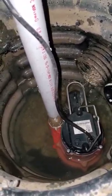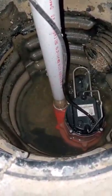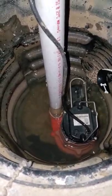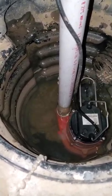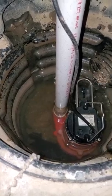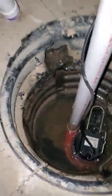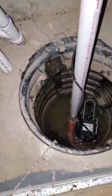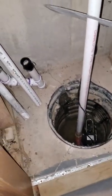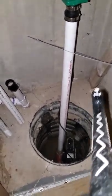The float switch had gotten stuck and it just took a gentle nudge to get everything working again. I'm making this video in case it helps somebody else — I usually don't make YouTube videos, but a couple of them were quite helpful to me. If you have a problem with your sump pump, first check the float switch. It might be something different, but if it's something this simple, don't go calling a technician on a Sunday morning like I was about to do, fearing a flooded basement. Hope this was helpful — good luck.